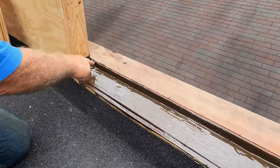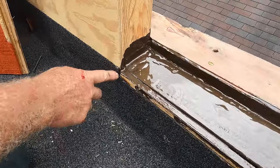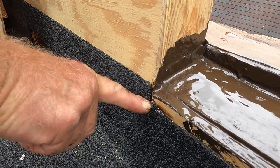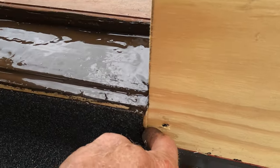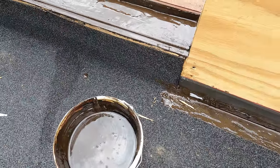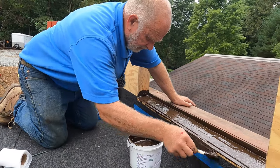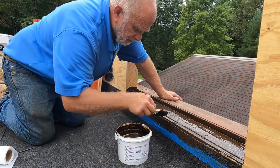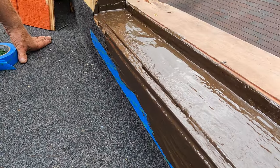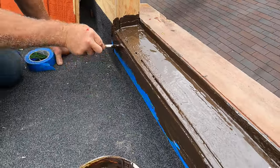If you make the pan, water will sit there and wants to flow out again — this is very, very crucial. Water would flow right into this corner, see where the membrane is? On the sides, right to this flashing. So you need to make sure this is covered. You paint this — very important, one of the most important steps if you have a door. You can see the plywood always has a gap, and water will leak in there if you don't fix it. So I had to remove the siding.